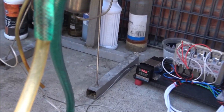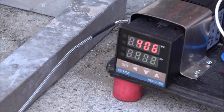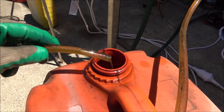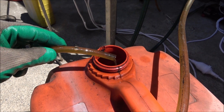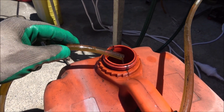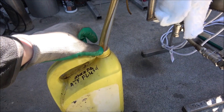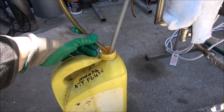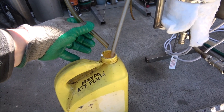The running temperature is 405 to 406 degrees. This is the production flow. Now I'll try to increase the supply flow and see how it affects the temperature and production rate. I've increased the supply flow — here we've got a light fraction coming out.